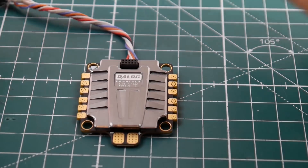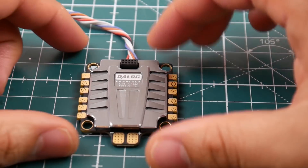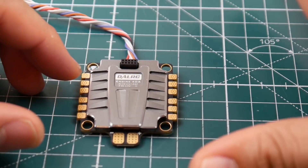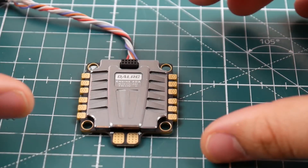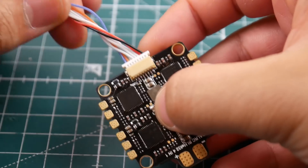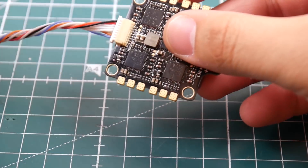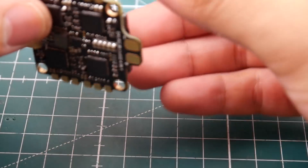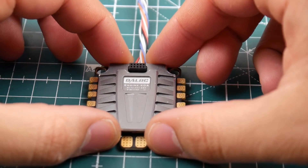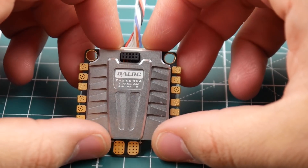However, you don't get some of the features you'd usually get with BL Heli 32 ESCs. For example, there is no current sensing for each individual ESC, there is no telemetry wire, and obviously there's no RGB LED. It does have current sensing, but that's for the overall board — the reading comes out through one of the wires which connects to your flight controller and gives you the current reading going through your motors. It also has a 5-volt regulator on board, which is pretty cool.